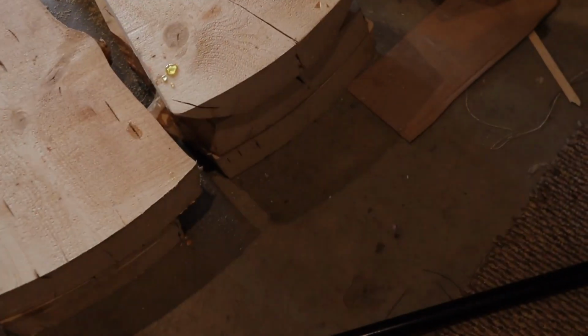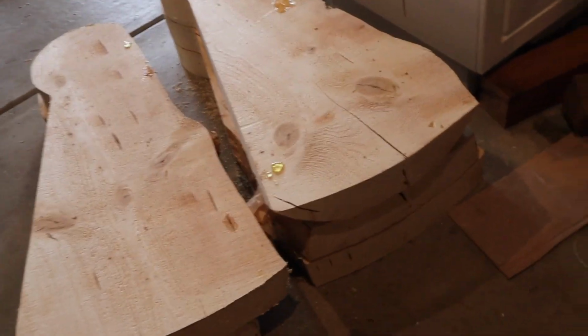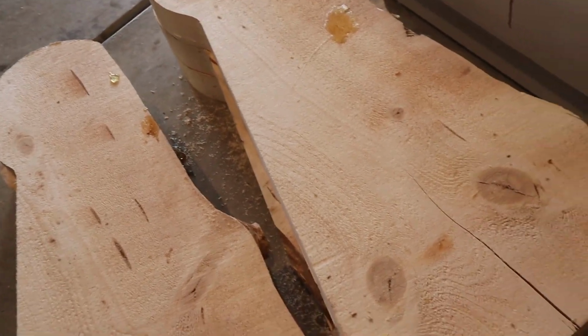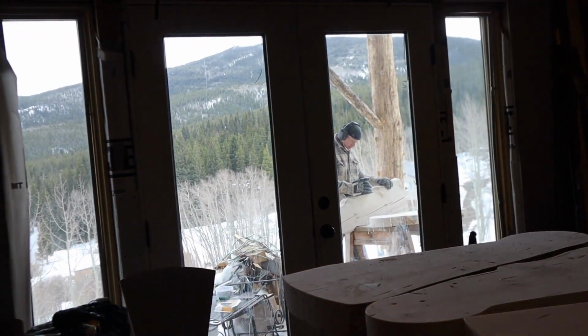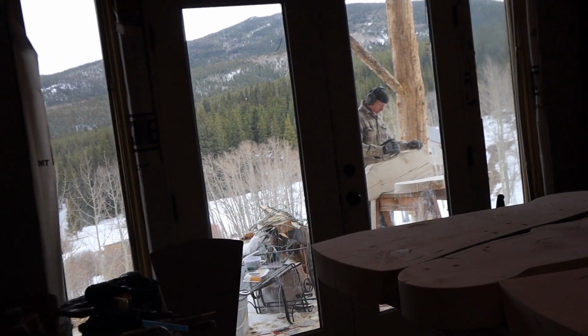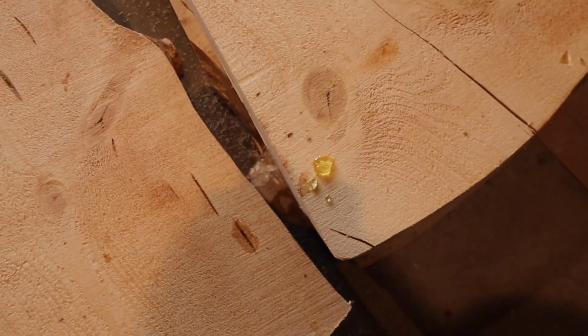We have plenty of steps to do as far as finishing these stairs. So the steps are in a few stages here. Let me show you, these are the finished ones ready for stain up here. And Bryan is actually working outside right now on this step. These are a few right here where all the rough cutting is complete, but they just need to be sanded. Now look at all this pine pitch that's coming out. This is a chronic problem. This is what is slowing Bryan's sanding down because it gums up his sandpaper on the sander. So he only gets through a certain amount before he has to change the paper. I think it's about 3 or 4. And he had to make a run to the store today in order to get more. So unfortunately, still dealing with a lot of pine sap.